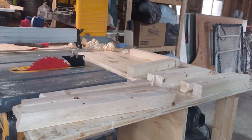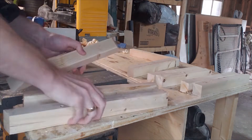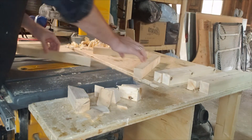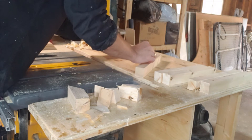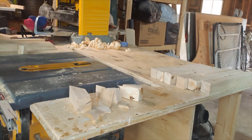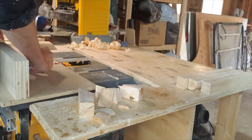For that job we're going to take out the 45-degree cross cut sled — which you might have seen in our box making video, I'll leave a link somewhere. After everything is set up, we just zip off these corners to make three diagonal pieces that go between the horizontal and vertical pieces. After putting it together and looking at it, I thought I'd just screw it together, but I wasn't sure about how heavy things would be. So I decided to put a notch in both the horizontal and the vertical pieces so the diagonal piece could recess into both of them for added strength. I marked where those need to go and used my cross cut sled, cutting all three horizontal and all three vertical pieces together so they'd all be exactly the same.